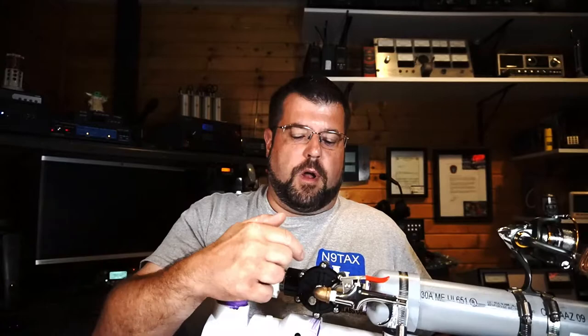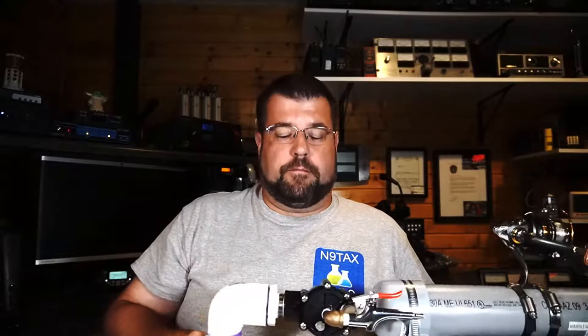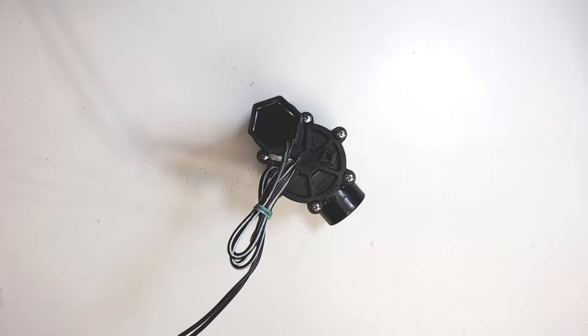There's a small equalizing valve in the diaphragm with a very small pinhole. As the chamber fills with air, both sides of the diaphragm stay equalized — same pressure on each side. When you quickly hit the blow gun, you dump all the pressure on the back of the valve faster than the equalizing valve can compensate, which forces the rubber diaphragm open immediately, dumping the entire contents of air pressure from the pressure vessel in less than a second. It's very effective at launching the ball.